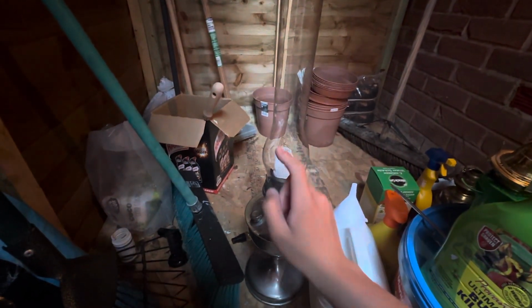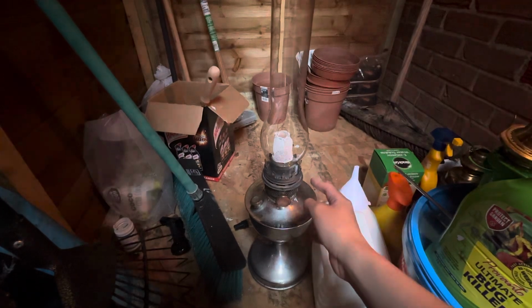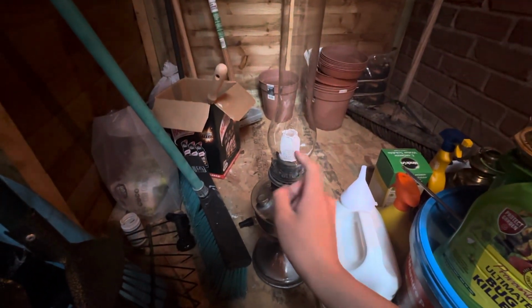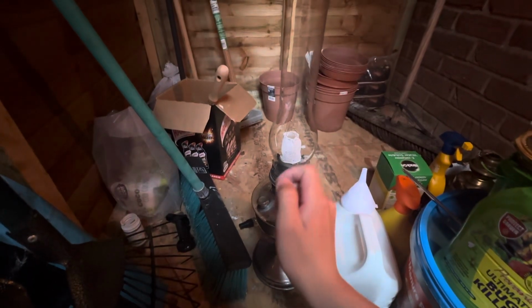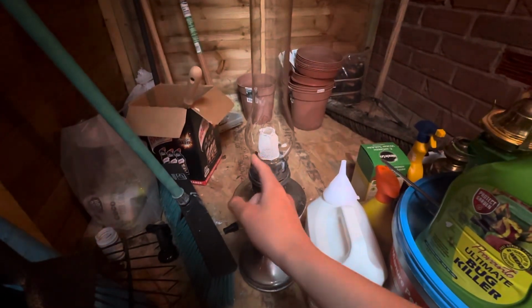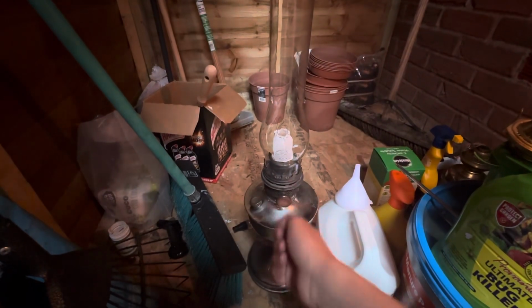So what I've done now is I've actually made my own mantle, calcinated the mantle onto a special cage, burned from top to bottom and heated it with a special blowtorch in order to completely calcinate the entire mantle. And because the shape is not really perfect, it will be better if it's slightly larger and slightly taller in order to provide a better glow.